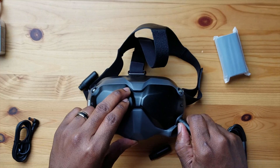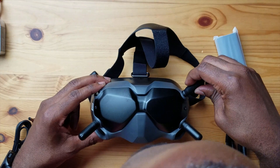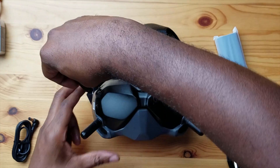Let's get these antennas on. I'm eager to put this battery in and power this up, but the number one tip here is never power up any accessory — especially transmitting or receiving accessories — without the antennas on. I don't think there's any difference between these four antennas, so they're all the same. We don't want to over-tighten and damage the threads, but you do want a good connection.